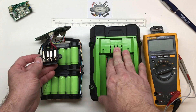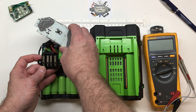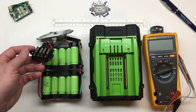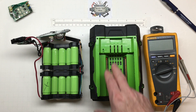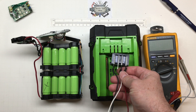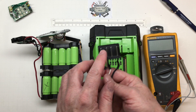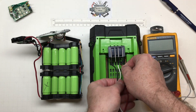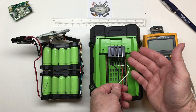I get so many questions about the terminals — what T or what D is. If the battery pack starts blinking orange after it turns green when you press the button, this is letting us know either we have a temperature problem or it could also be an overload condition. This came out of the blower that we did fault-finding on, and we can see it does have four blades, but we actually don't use the T on that tool. Some tools don't use the T; however, as far as I know, every tool uses the D. I have no schematic and no contact that works with Ego, so a lot of this I just learned because I wanted to learn more about it.